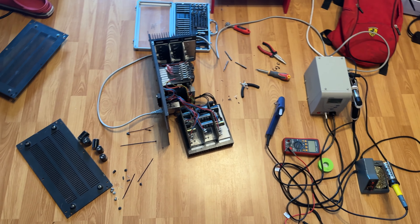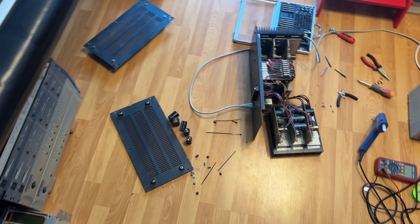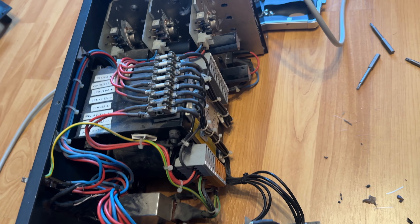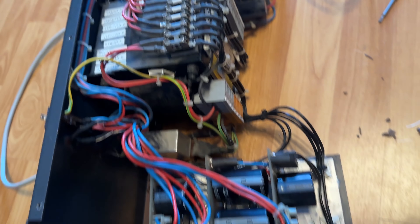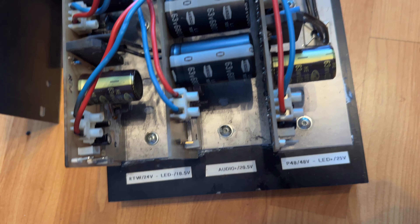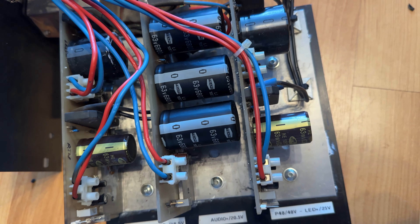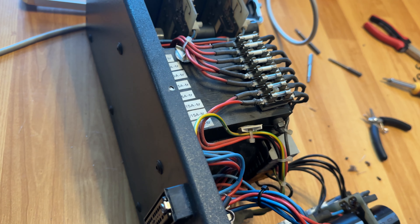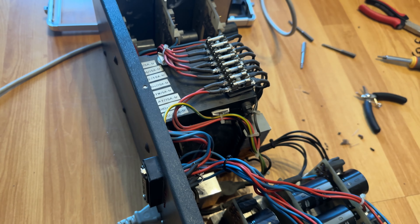Let me show you the power supply before I build it back together. As I said in the main series, big transformer - and I upgraded it, so you can see here new big capacitors in the main audio supply to stabilize things a bit more. These are awesome. Same over here. Two other very nice improvements I did: this was humming quite a bit, and knowing from earlier builds this can happen when the transformer is mounted a bit loose as it swings, especially big ones. So I fastened these screws.